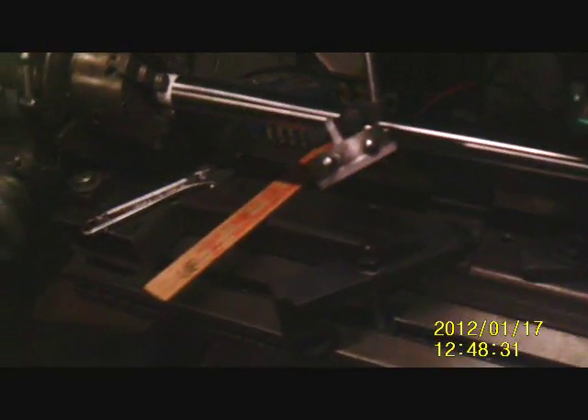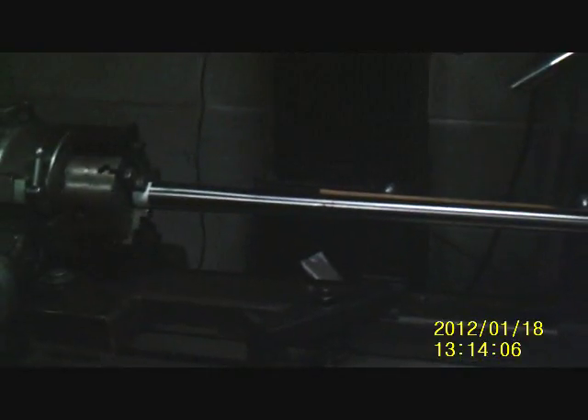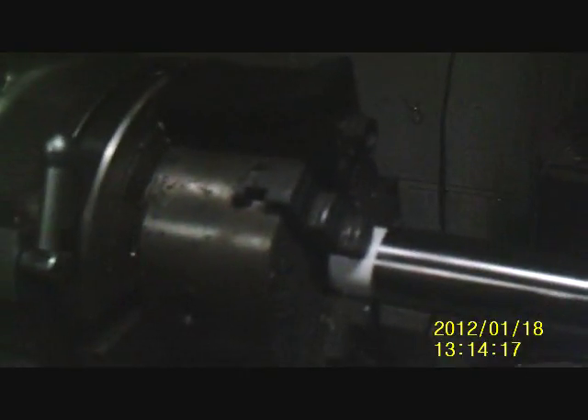This amazing paint stick pushes against the back of the barrel while we're cutting it, so that it doesn't just deflect out of the way and cut a cruddy flute. Right now I'm just dialing it in down in the taper. When I get it ready to cut I'll show you. It's not rocket science, we're just cutting metal. Barrel's all dialed in, put a little electrical tape back here on the thread so the chuck doesn't ruin it - seems to work good.